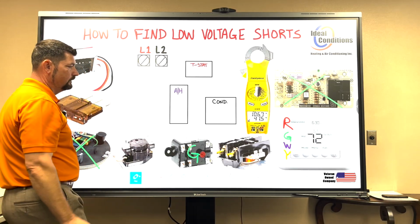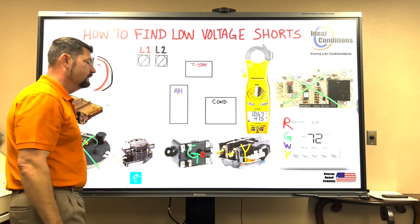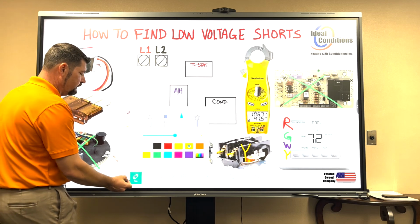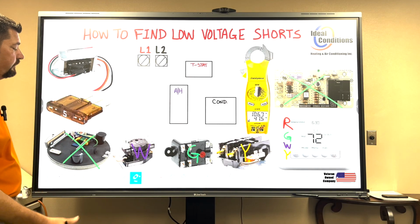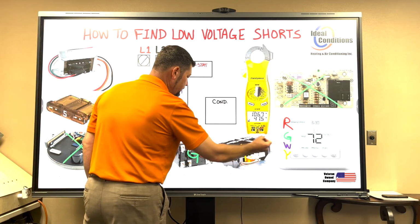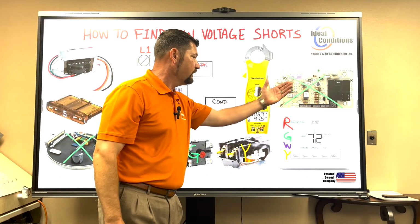Let's pick another color. My contactor on a straight cool application, start looking at your contactor a little bit differently. Look at that contactor as a Y call. And that's all it is. Now let's look at this other relay, not the blower relay, the heater relay, as a W call. And so we have G, G, Y, Y, W, W. We're not using the module here again. We're not using the blower control board here.